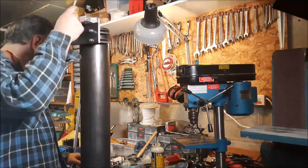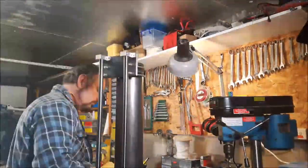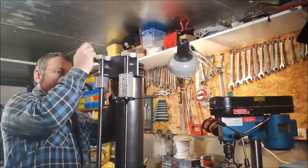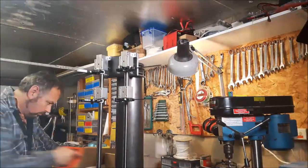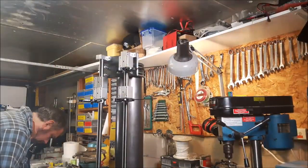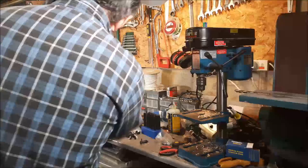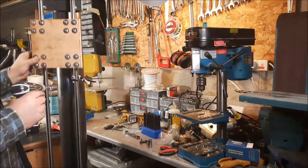As you can see I'm bolting those rail supports on — there's the first one on. The same process for the second one; you can see the rail supports are above the top of the tube, just to make the most of them. Now this is all laid up a bit crudely — not set up properly in terms of geometry at all. I just wanted to gauge how this all fits together. So I'm making a plate just to mount the linear bearings on to get some confidence, and I'm going to use an MDF plate to mock up how I'm going to secure the ground end of the radius axis as well.